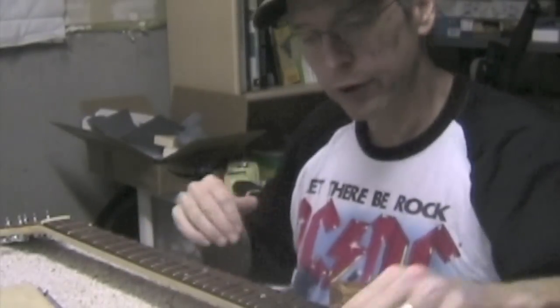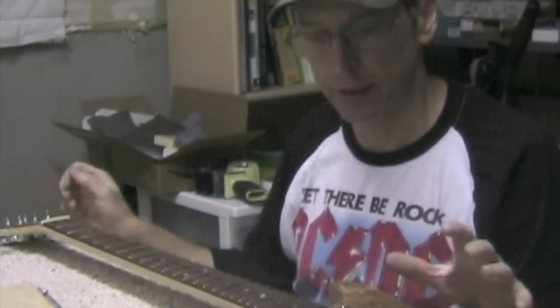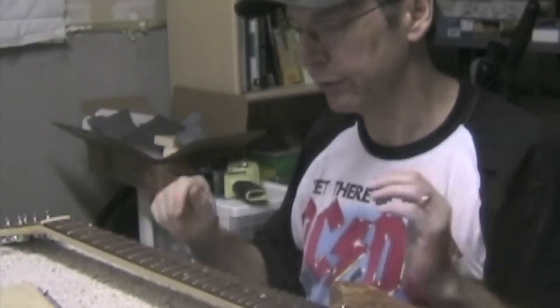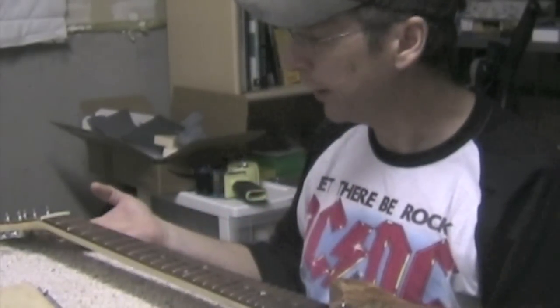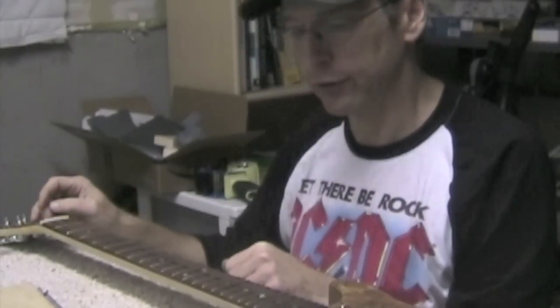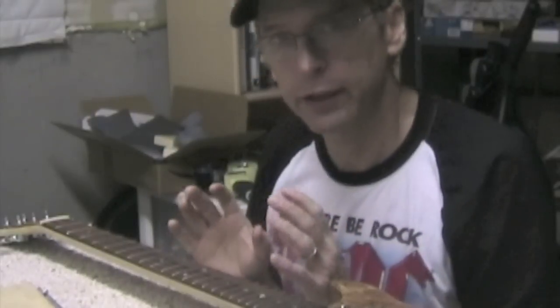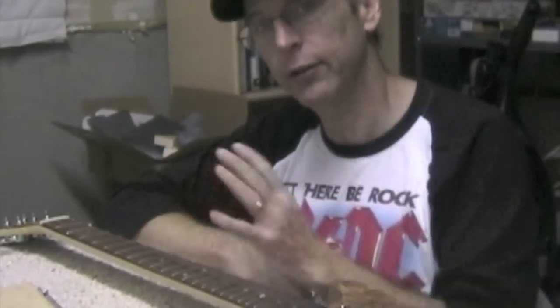Once you get a nice 35 degree angle cut along the side and the guitar assembled to this point, we can start looking at doing the final fret dressing. As you can see, the strings aren't on this guitar yet — I took those off because it's much easier to level the frets without strings. However, when you have the guitar strung up, the tension created by the strings will pull up on the headstock and create a little bow in the neck, which can be controlled by adjusting the truss rod. Before you do any leveling, you have to ask yourself how you like that fretboard to sit — do you want it nice and flat, or do you want a slight bow in it? Some people actually prefer that.